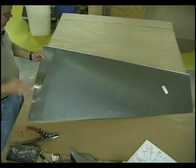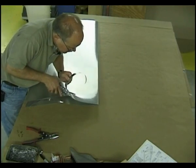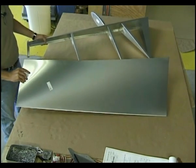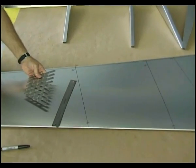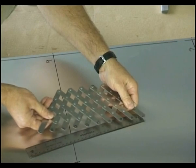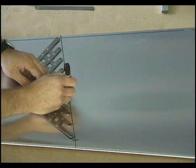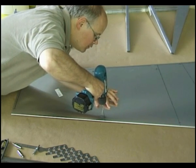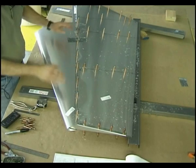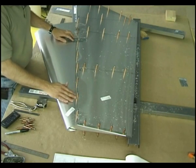Now let's turn this over. At this stage, we're going to insert the skeleton inside and start getting things set. Now we're going to simply line up our fan so that we get 40 millimeters between each one, marking where all the rivets are going to go. I turned it sideways just to make it a little easier to drill, but that should finish up all the holes at a 40 millimeter pitch distance, all up and down the spar.